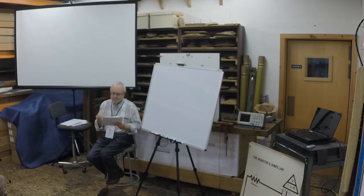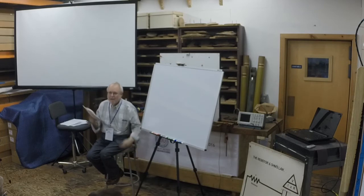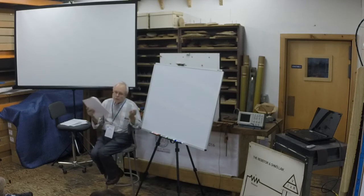Page 19, what kind of voltage drop are they talking about? I have no idea. I just copied the page. Of course, they're going to have to decide how much voltage drop is reasonable for this length of wire and this gauge of wire. Obviously, you could use welding cable and there'd be no voltage drop, but you wouldn't stay in business very long.